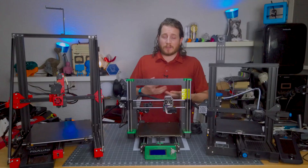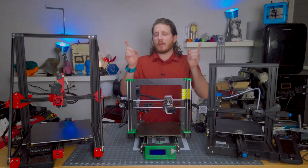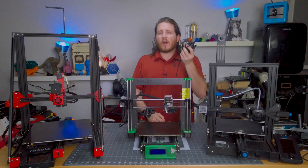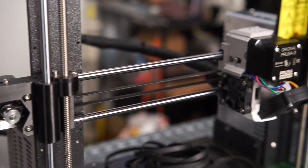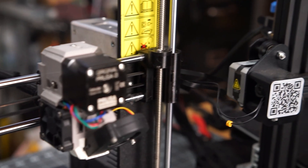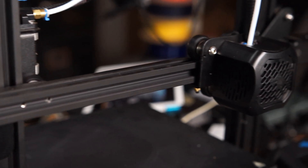If you found this video because you need new belts, you're welcome — links are in the description for open loop. If you need closed loop belts, you need to measure the exact circumference you're looking for and order that. Belts are one of the core parts of a 3D printer; they basically keep your X and Y axis moving smoothly, and in some printers even the Z axis. But over time they can stretch and become a major headache if you don't know what to look out for.